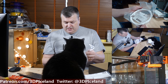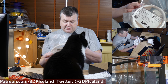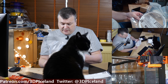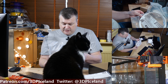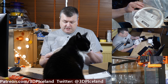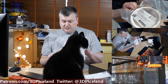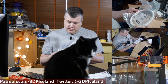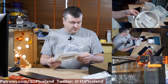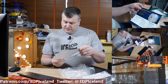The last one is vacuum packed from FormFutura. This filament is called STYX-12 and is an industrial grade PA-12 nylon filament. It combines excellent mechanical, chemical and hygroscopic properties with printability. It prints at 240 to 270 degrees with a bed temperature of 80 to 120 degrees. I look forward to trying this out as I haven't done much nylon printing — only from a Megabox sample before. There's also an advertising sticker from Verbatim with some information about their filament.